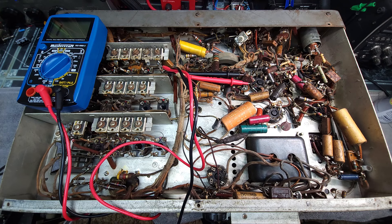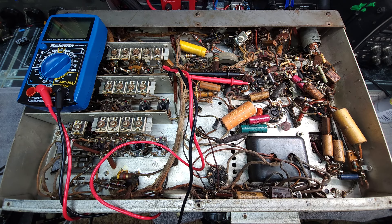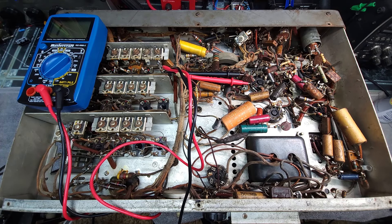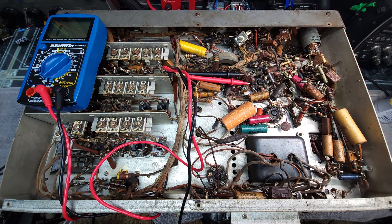We're back, and the news isn't great. The second IF transformer — it's a double, it's a biggie. One of its windings is a dead short, and the other one is open on that same tower. That's a bad thing. In my experience, that'll be a cooked transformer for sure. I highly doubt it'll just be a wire off — certainly not the one that's a dead short.